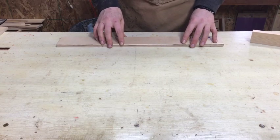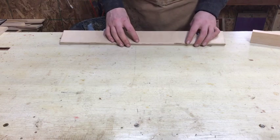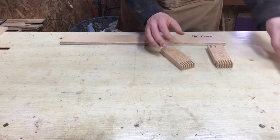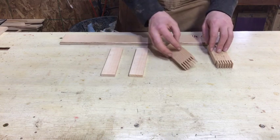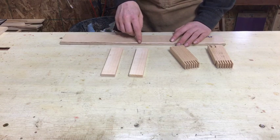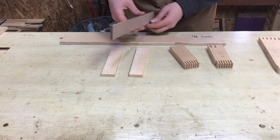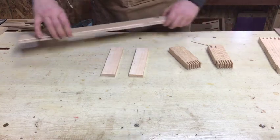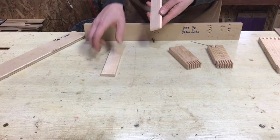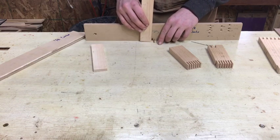Now that we've got the round over on this, we need to make a key decision before we cut our slot. We need to consider what thickness of material you plan to work with — very thin material, thicker material, normal three-quarters, or do you want to use both? This is important because it's going to determine how high we cut our initial slit and how tall our peg will be. The one I'm replacing was made for very thin material — the saw blade only needs to go through the same thickness as the mating piece.